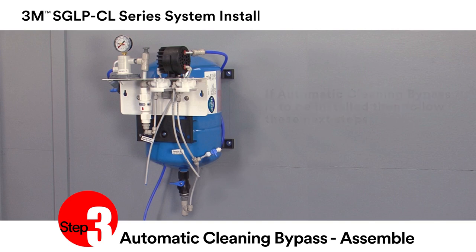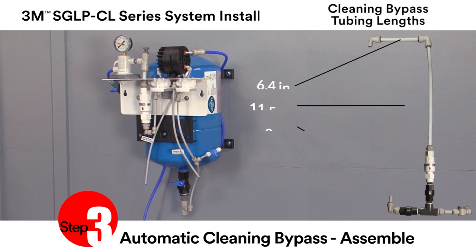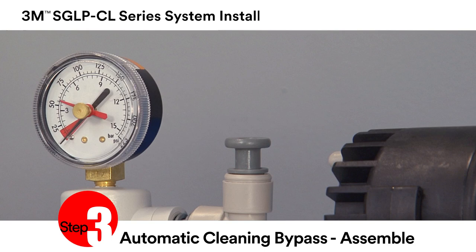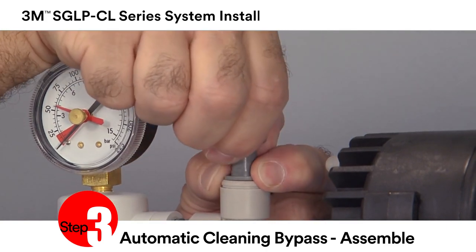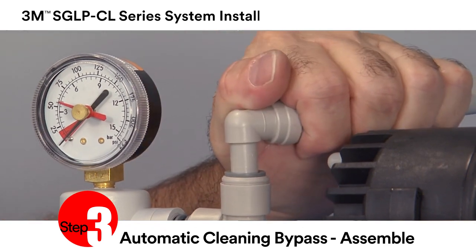Step 3. Assembling the automatic cleaning bypass. For models that end in a BP suffix, the automatic cleaning bypass parts were included with the system. Cut 3 pieces of 1/2-inch tubing to the lengths noted. Assemble them to the automatic cleaning bypass along with the fittings. Remove the plug from the quick connect fitting located at the top of the unit. This can be done by pushing down on the gray collar, then pulling the plug out of the fitting.